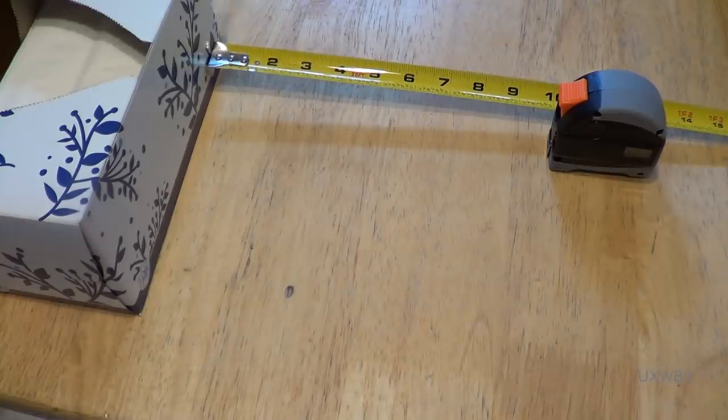Whenever you're making measurements with a laser rangefinder of any kind, you need something for the beam to hit. For example, if I wanted to measure one end of this tabletop to the other, I'd have to establish a backstop of some kind, and that's what I've done here. I've set this Kleenex box at the edge of the table. I've also set up my conventional measuring tape. I pulled out about 16 inches worth of tape, but I positioned the rangefinder right at the 10-inch mark, and I turned the compensation functionality off.